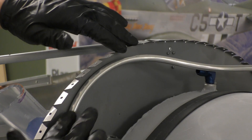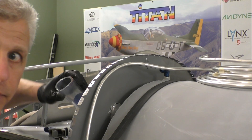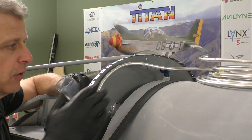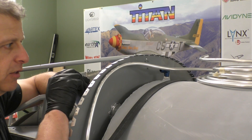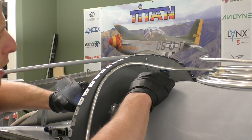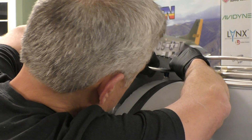You can see I've brought it up over here — this is the fuel filler. This is where from the outside of the airplane the fuel is going to get filled. I really want to keep the vent line as high as possible because you're going to see the fuel as you put it in here and you'll see the level till you top it off. I want to make sure the vent is as much on top of that as possible.